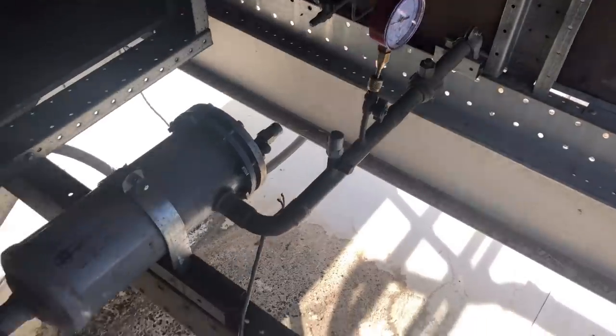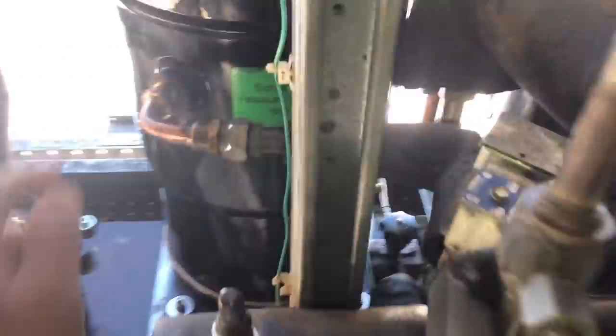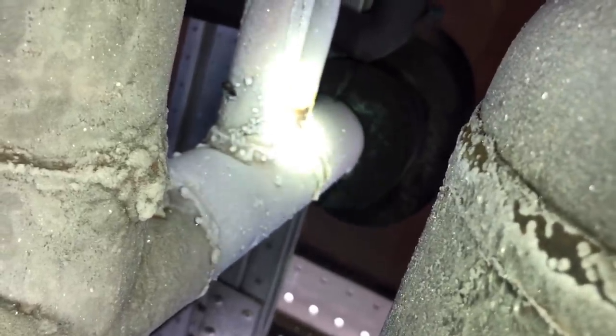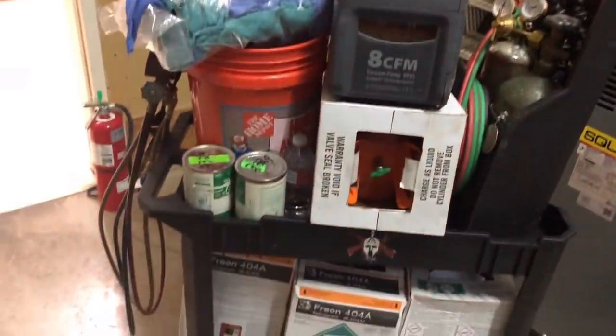That's what we're doing today. We're back and we're going to use high-acid dryers because this rack has already lost one or two compressors lately. We're going to do the dryer, but my buddy just found a leak right there — that's oil. We're going to verify it, but first we'll change these dryers out. That joint has already been repaired once or twice, so we need to see what we're dealing with.